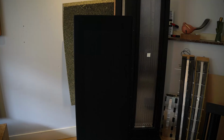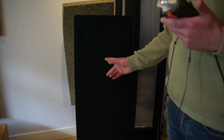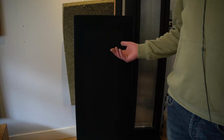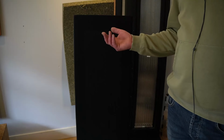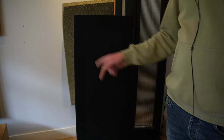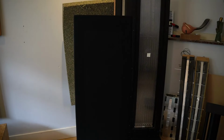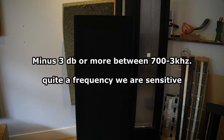And it might not, I don't know why, maybe because of the tuning knob / tie downs, or I got a set that are meant to be together, but somehow this tweeter measures completely different than the other one, which is not cool. The other one measures quite nice, and they play pretty low and have a really low distortion, but it's not cool to have one tweeter that has a completely different frequency response, in my opinion.